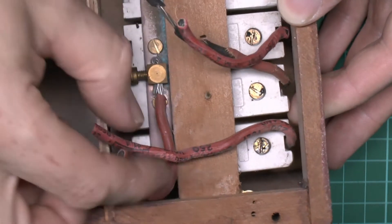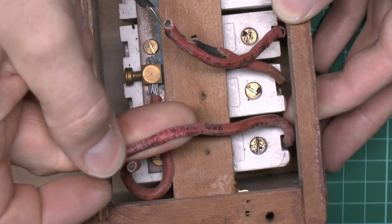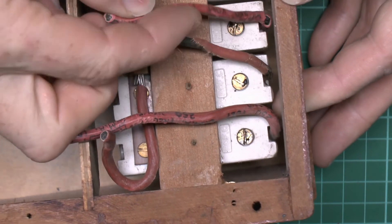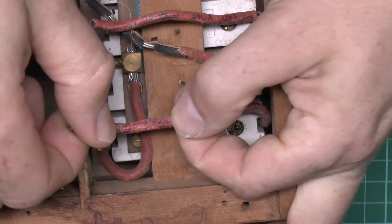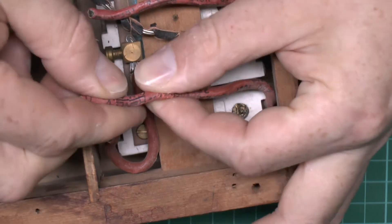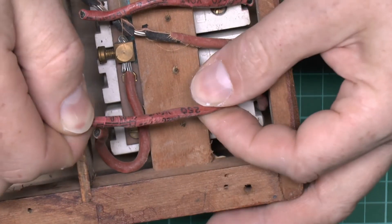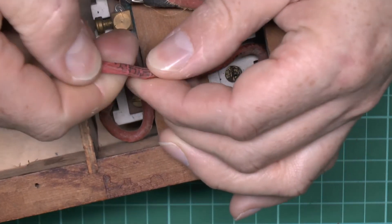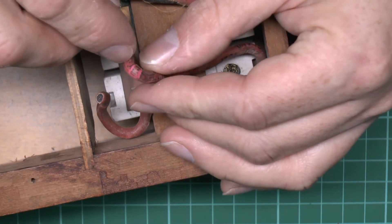There's a bit of wording left on this cable — just about visible. It says 250, which would be 250 volts, and there are remains of 'Made in England' at the bottom. There might be 'CMA' in there as well, though it's quite difficult to make out. The rubber insulation isn't too bad at this part, although there are a number of fractures, and if you bend it, it does the usual thing of completely cracking and fracturing apart.